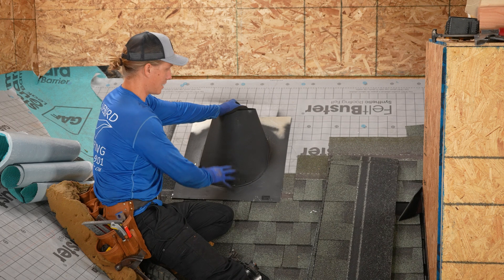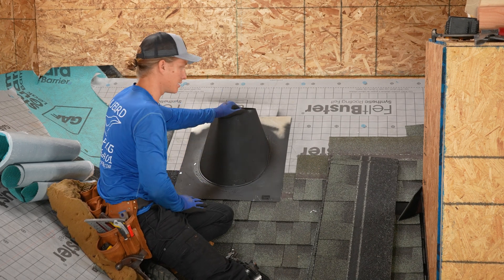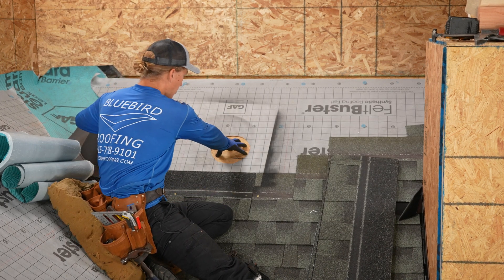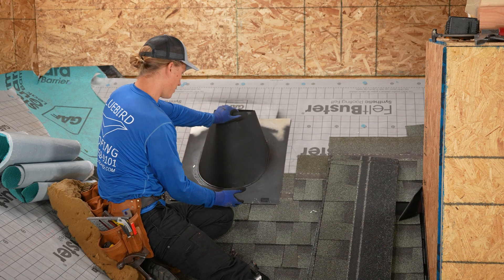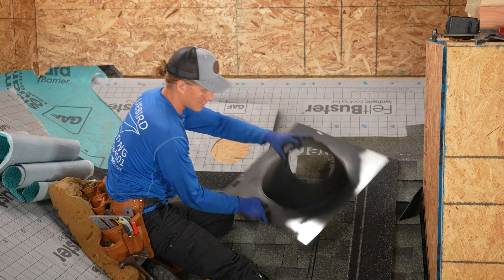This situation is a metal pipe flashing. These pipes are venting your HVAC systems and furnaces. I've got our hypothetical hole right here. The metal base goes over top of that. What we're going to do first when we get our shingles up to it is to install some ice and water shield around it.